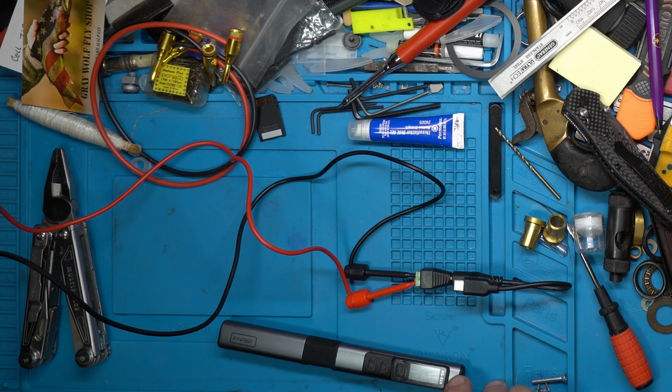But a plain old dumb power supply that'll give you 20 volts at, let's just say 2.5 amps. I think that's a good deal. I'd really say 3 amps. I think your iron will start at 100% power with no problem. Your voltage may fluctuate on your iron and it may heat up slower while the voltage is fluctuating to do that. Now, if your power supply can output 20 volts at 5 amps, I believe you will be able to start 100% of the time at full voltage and power and just bump up there really fast.